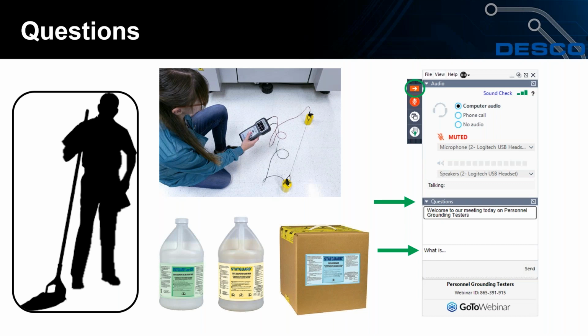Another question here. Do I ever need to strip the material? We do offer a stripper, and you can strip the material. Generally speaking, if you're maintaining the floor finish, the electricals are not going to go out of spec, but the appearance of it is not going to be as shiny. It's going to be harder to keep the aesthetics up over a long period of time. So we do find that if you're in a high visibility area, like a place where customers visit, and you want the area to look really nice, typically they end up stripping it about every year or so.